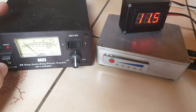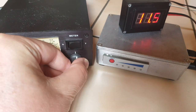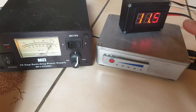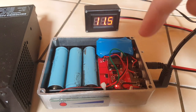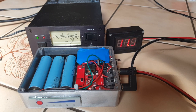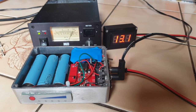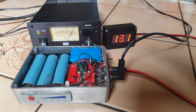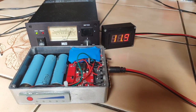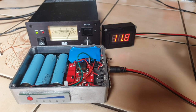Now I'm going to test the MPPT charger — I'll input 16 volts and theoretically the voltage here should be increasing. There's an LED on this MPPT charger and it is on, so it's getting power and hopefully the voltage will increase. A while later it's still on 11.5 — it doesn't seem to be charging with the MPPT charger. The BMS however seems to be charging; at least it's doing something. I'll unplug it and indeed the voltage went up — it's working!